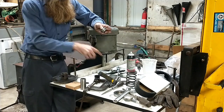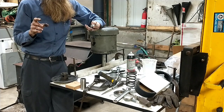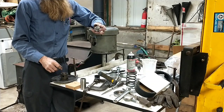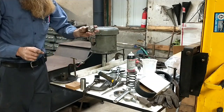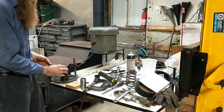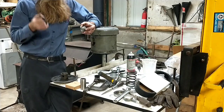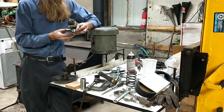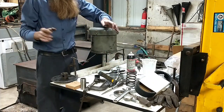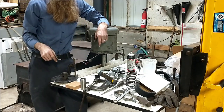And then something else I want to point out, sometimes these bearings go bad, the bushings aren't bad, and you want to pull that thing off. If you just do that indiscriminately with something pushing on the end here, these bushings frequently stick out past the edge a little, you will break the bushings loose. So this one, you can't see it on the camera, but I've machined this so that this ledge on it has a concave surface, so that it's actually touching out around the outside, specifically so that it will not be touching the bushings if I have to pull a bearing without wanting to replace the bushings. Now in this one it didn't matter because the bushings were bad anyways, but just mentioning that, you've got to be careful about it if you're replacing this bearing. This bearing was shot, had a nasty howl to it.